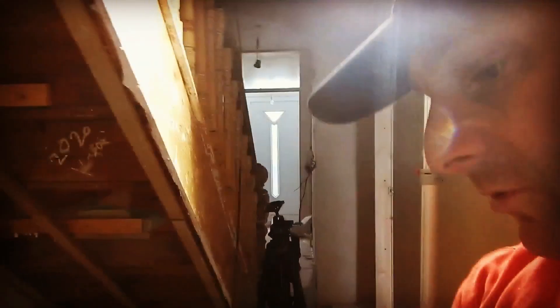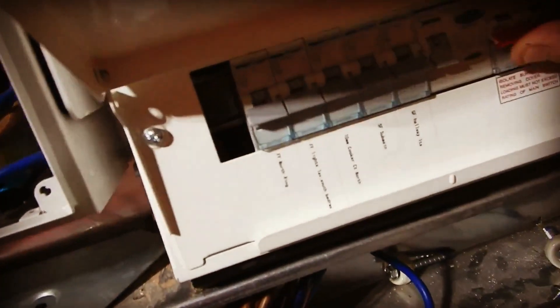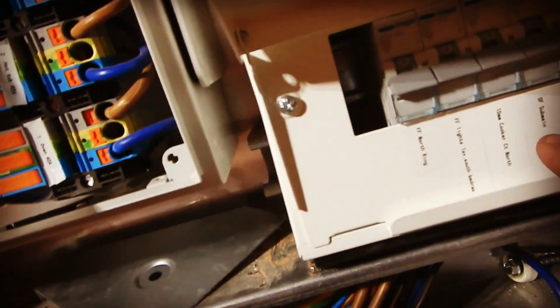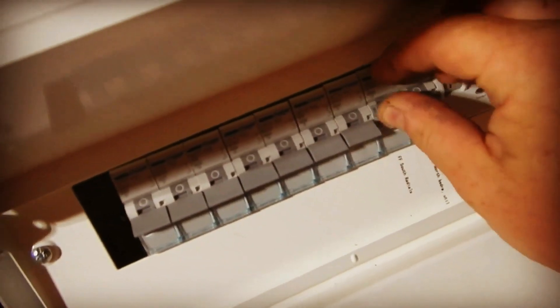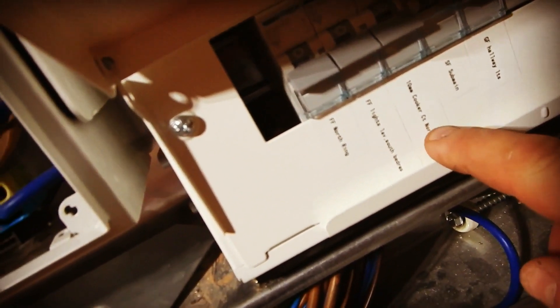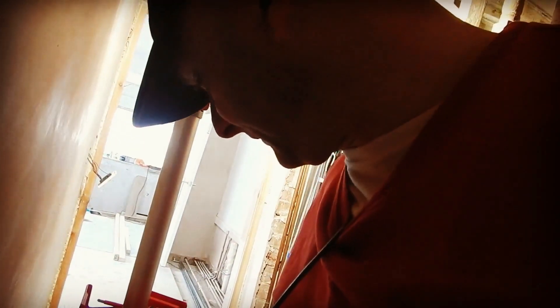I hope that's been of some interest - it's an unusual install as you can see. I've also put a main isolator switch in for the whole system. All that remains is to switch on down here and wait for a bang. I'll stick on the second floor sub-main, the first floor south radials, and the first floor north ring - so we should have electricity up there now. Let's go and see.